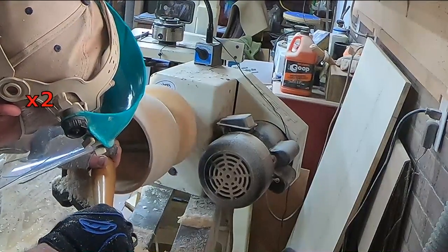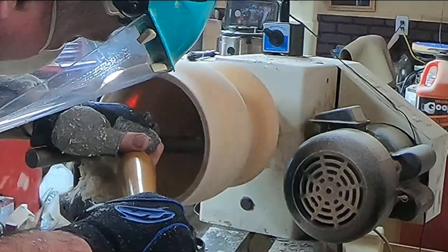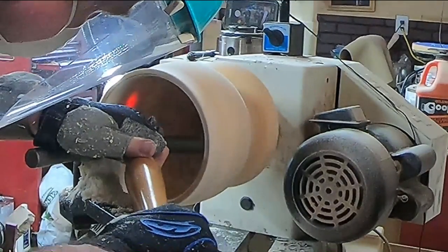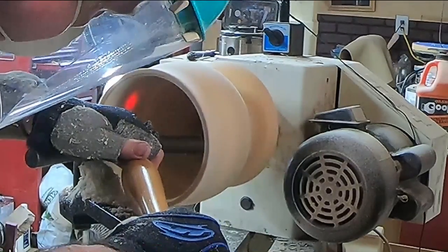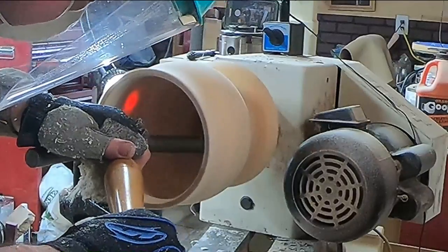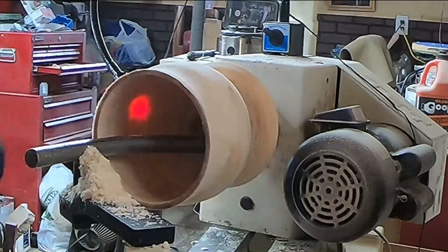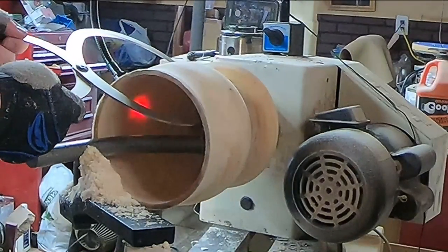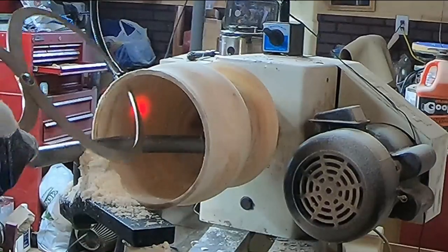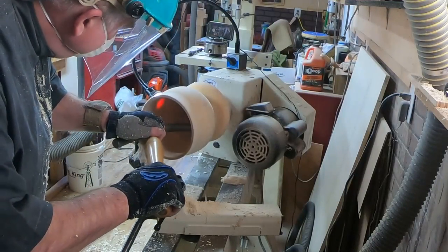So the light is positioned in one spot — I'll shave off a little wood here and a little wood there, ultimately getting this shade down to about one-eighth inch all the way around the curves, even all the way from the base to the top. The light helps me make things even, but the calipers assure me that I'm not going too thin — it's just a way of double-checking that I'm on the right track.